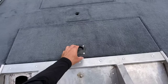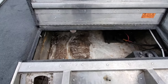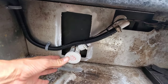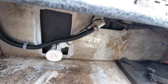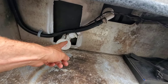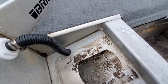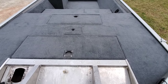Back here, carpeted the lid. Beyond that, just did a nice job getting the carpet around the edges and tucked just like it was from the factory. What was cool was adding that pump — had to cut the sheet aluminum to give myself access. Originally I was going to put the Flowrite right above it, but due to the water level I feared there would be cavitation, so I moved it more towards the center. The Flowrite valve there recirculates the water, and when you pull it on the inside it activates the second pump — instead of sending it as a recirc, it sends it up and back through. I routed the hose and it comes up, out, and through the transom — that's his pump-out for the livewell.